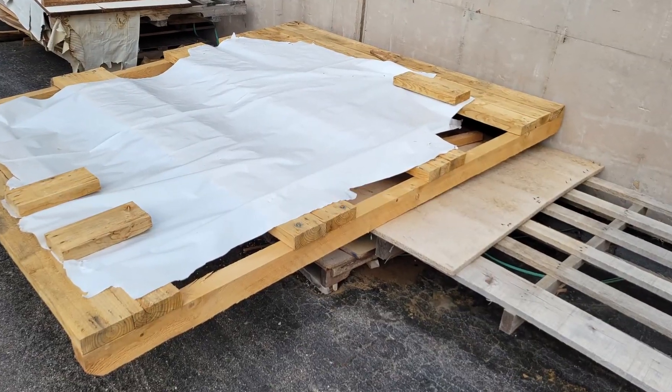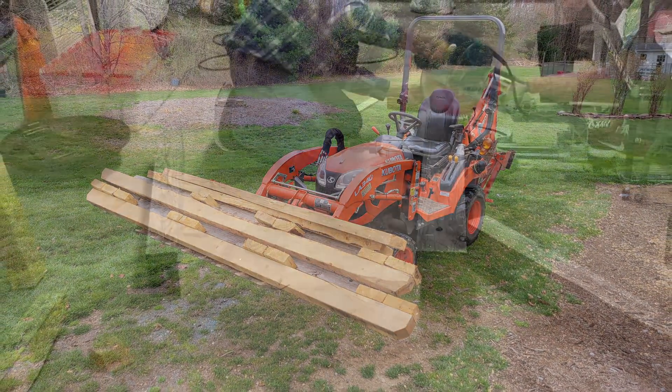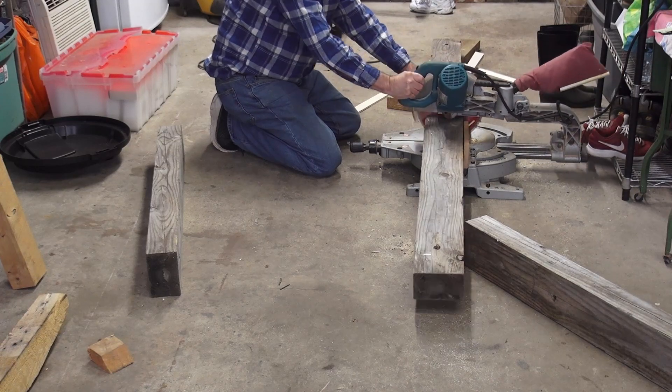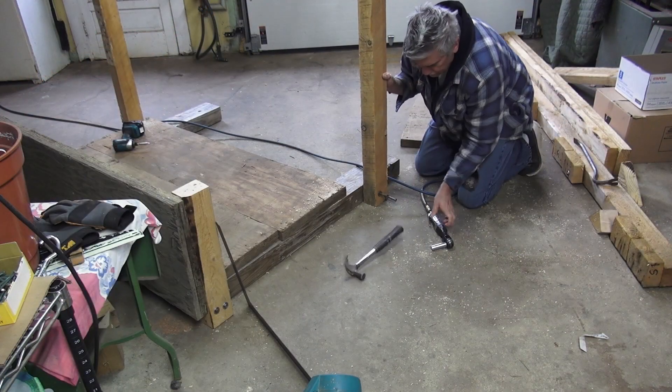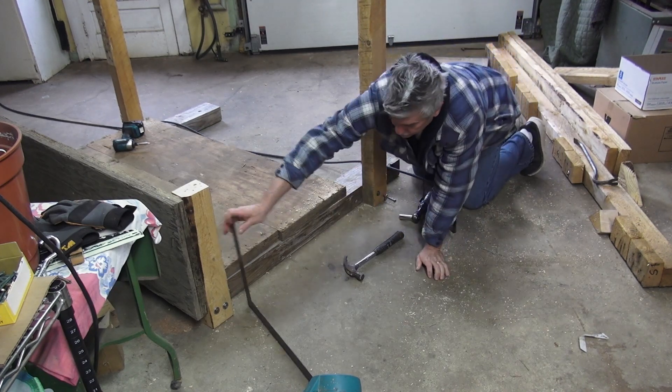For the frame, this old machine pallet will work. It's heavy duty, I don't need a welder, and it's free. I estimated how high to make it based on the dumping height of the bucket. You should always load this from the high side if you don't want rocks bouncing off your tractor. I also want the low part of the separator high enough off the ground so the stones have somewhere to go and don't back up onto the screen.